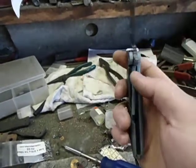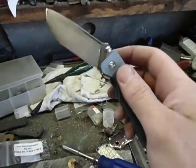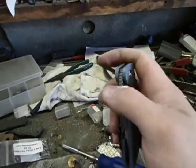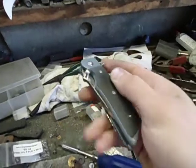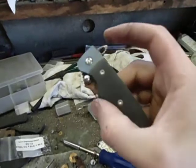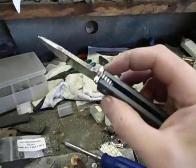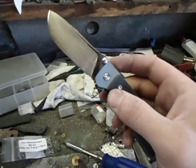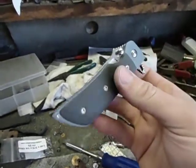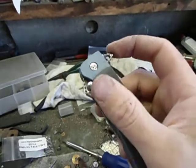No titanium clip. This is an unlubricated flipper — this is the preliminary assembly. Usually before I send stuff out, I take them apart and clean everything again and lubricate everything up, so by the time they're ready to go out, they fly. I've gone back on this one to a thumb stud stop for the blade. A lot of guys do it. It's actually fairly easy to lay out that way — you don't have to worry about the internal stop getting in the way of the flipper trigger.